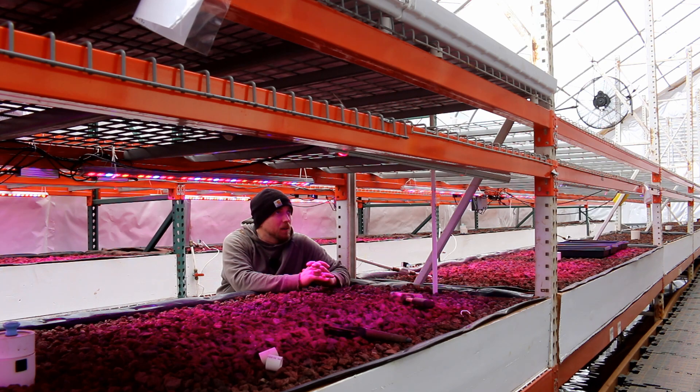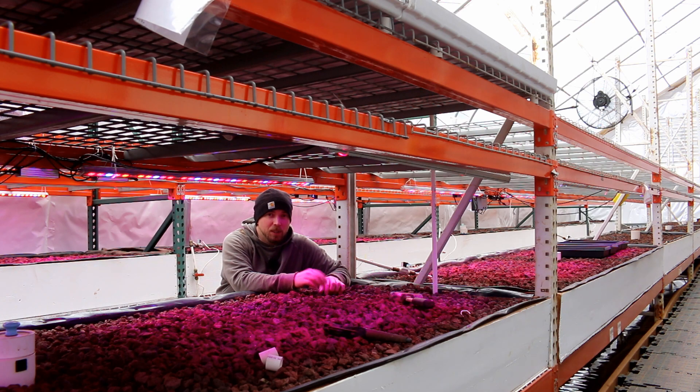Figuring out the plumbing is something I'm going to work on. Also, the well water is a cool experiment, but every time we fill one of the beds and drain it into the aquaponics system, we're raising the level of water in the fish tanks. In winter that means eventually we'll have more water than we need, so we'd either have to drain the fish tanks a little or run drains into the main drain system of the building. Right now I'm leaning toward aquaponic water being really good for us, as long as it doesn't touch the edible part of the plants.